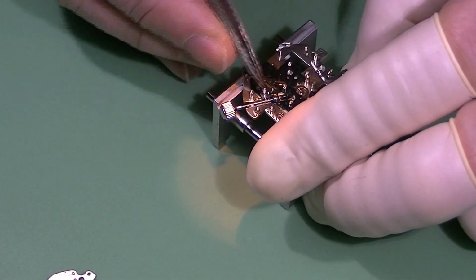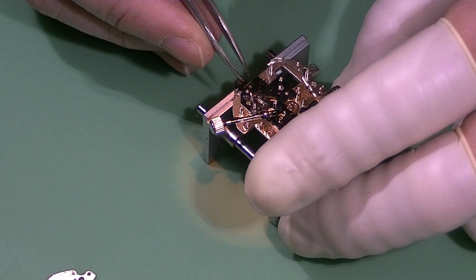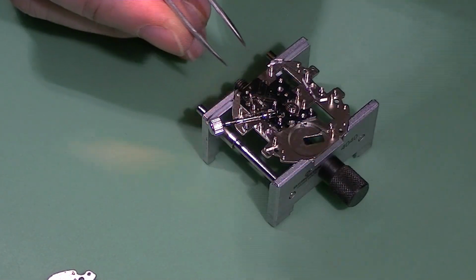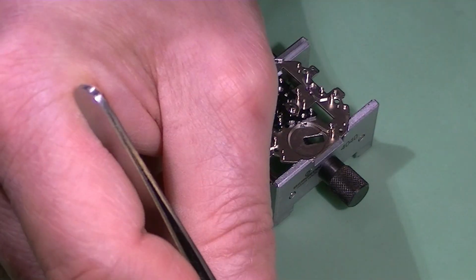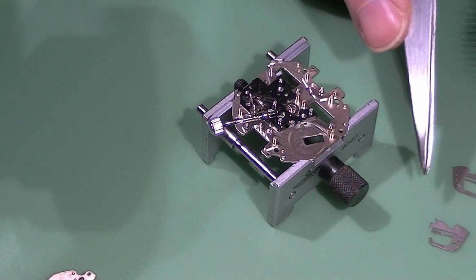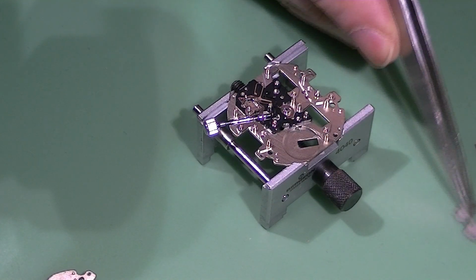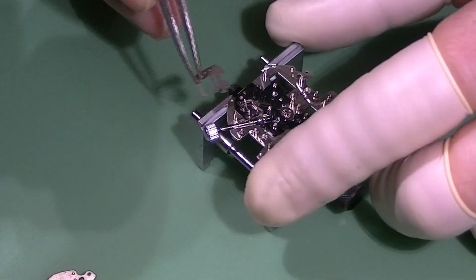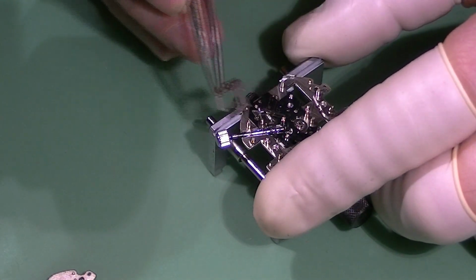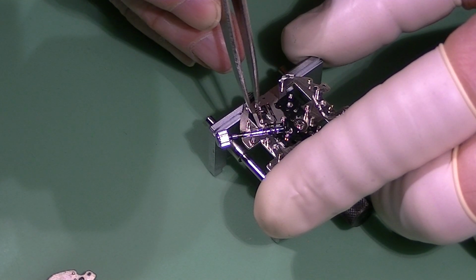This is also a very flimsy part, and I've seen a lot of watches with this switch lever with the protruding part damaged or bent down or even just plain missing because the watchmaker that had serviced it then was just careless. And this is the setting lever spring. It is the plate that acts as a spring for the setting lever and also holds down the yoke in place. So this is the first screw that goes onto the main plate, should I say.